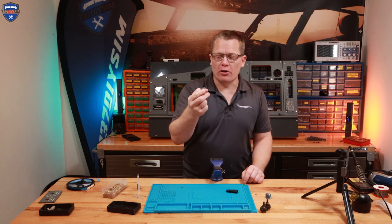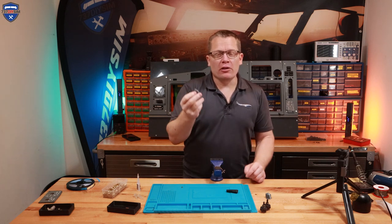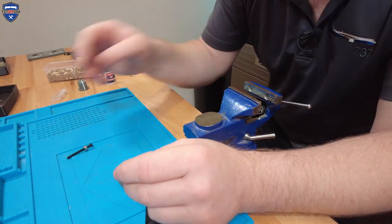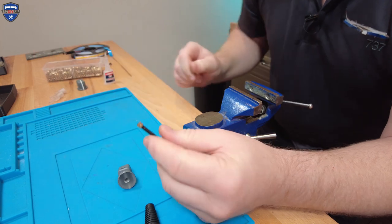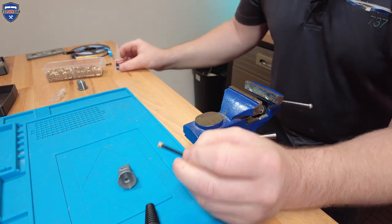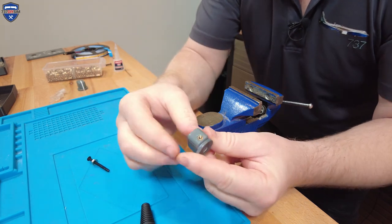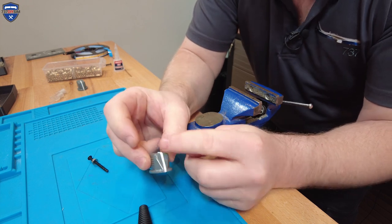We've now got to fit brass inserts to our general knobs. These are the 737 knobs, printed in clear translucent, which means they should light up when we put light on the back of the knob. This time I don't want to put the knob in the vise in case it damages it on the metalwork, so we're going to screw the brass insert onto an M4 screw, cover it in CA glue, and just push it into the knob. There's the clear section that we're going to backlight so the white section lights up at night.